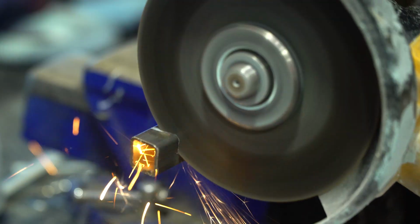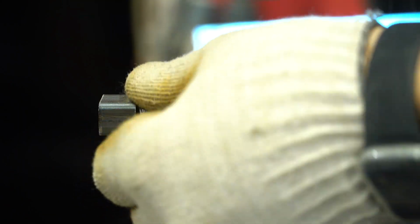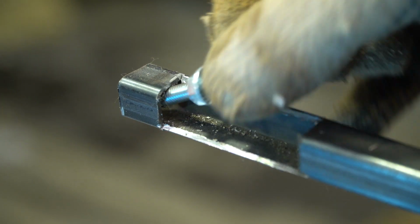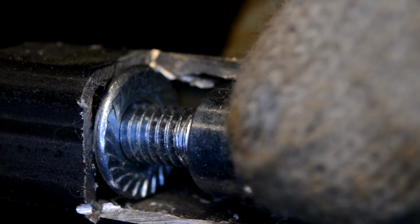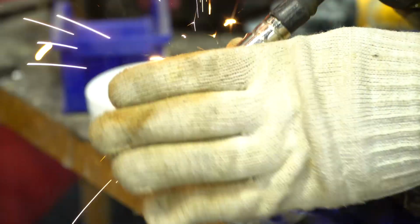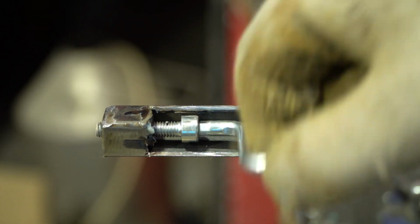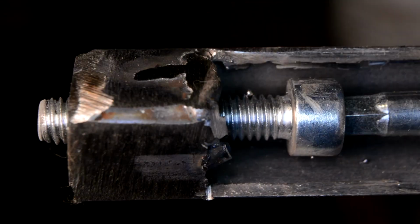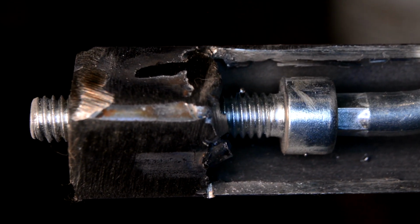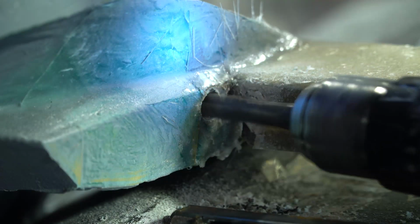While the resin was hardening, I started making the wings. The wing axis will be made of the profile pipe. The wings will be attached using such a mechanism. I cut a segment at the end of the profile. There will be inserted a bolt and welded 2 nuts. The wing will be inserted into the main part of the spoiler and mounted with screws. I printed such kind of bushings for them. They'll be glued into the side parts.